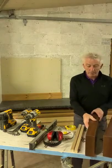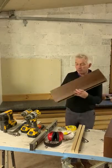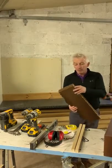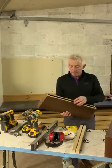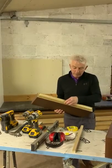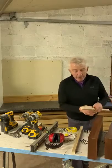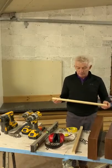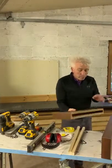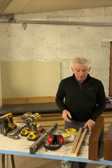Floating shelves — you can buy them in any of your local DIY stores, but for this purpose I actually made them myself. I've used some 18mm walnut melamine MDF. I've mitred the corners and kept it nice and chunky, which means I'm left with a decent size space in the middle for a solid baton that will go in there. If you buy them in a DIY store, they'll usually come with a metal bar, but the fitting process will be very much the same.